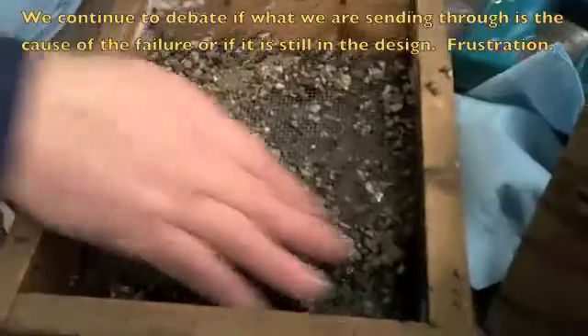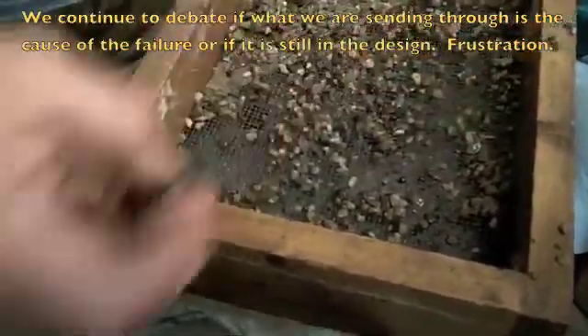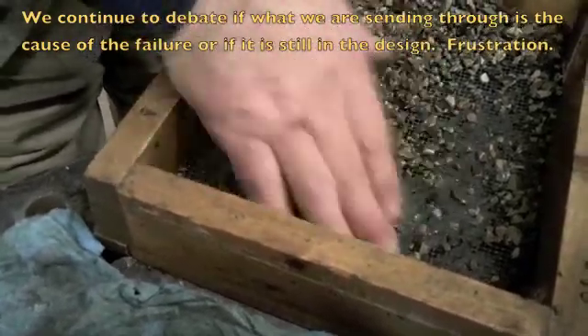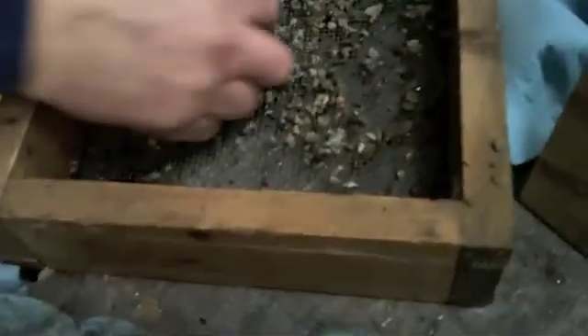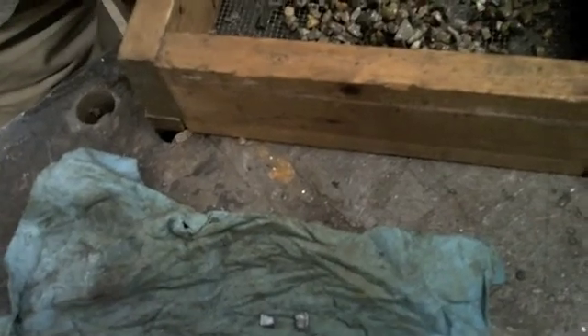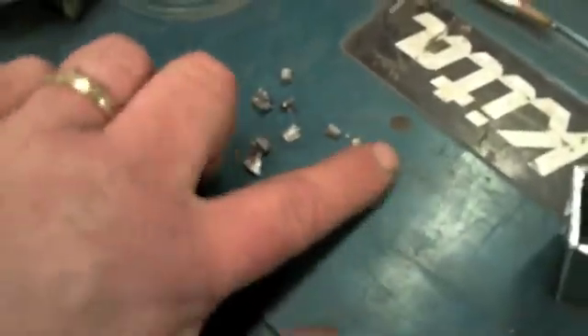Well, not the way they showed it on their video — they didn't put anywhere near enough material into the thing to even begin to fill up that spiral. In the video it was mostly black sand and bolts. And so far I haven't found the black sand and bolt line. Granted, that screen would have dropped all the small shavings out. But I mean, if that was our gold nugget catch, that'd be a fairly substantial loss. It does mean that it caught more than I saw it catching. I may not have caught a hundred percent of what was coming out — catching most of it, it was very little. As far as I'm concerned, even one of these is pretty much a failure. So at the seven-degree angle, slow feeding mixed media, we still get that much out the far end of the trommel. As far as I'm concerned, that one is a failure.